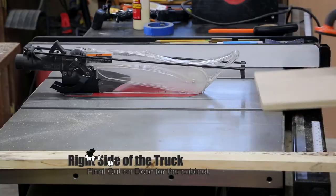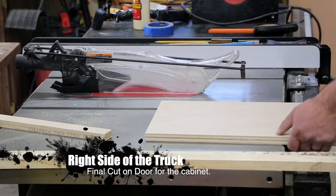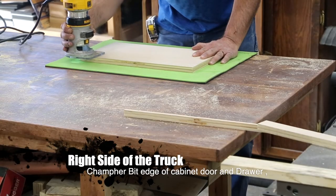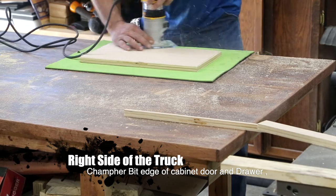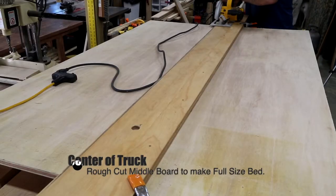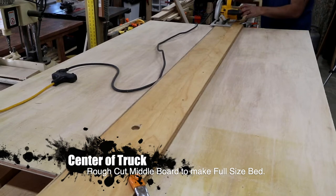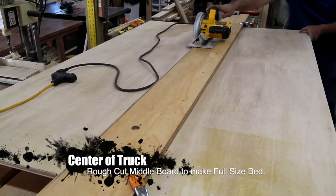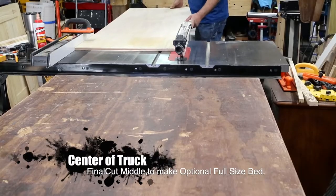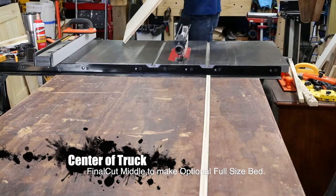We didn't use piano hinges on this build out for the door. The drawer is built old-timey style — we've got hardwood runners so that the drawer slides in and out nice and easy, and hardwood sides so it doesn't get cockeyed when you're pulling it in and out. His plywood was already pre-cut, so on the bed side — the driver side — you'll notice there's a little bit of a hole. I made that drawer front bigger to cover it up, and that way he can also put a fire extinguisher right there handy towards the tailgate.